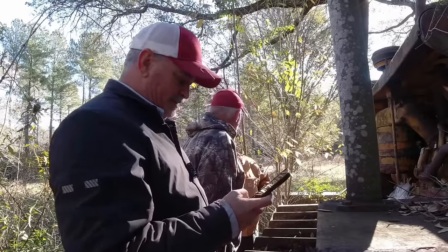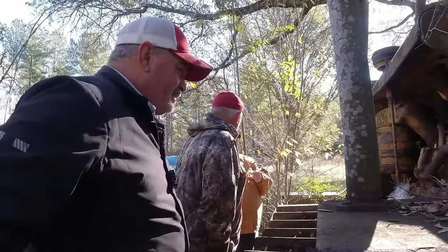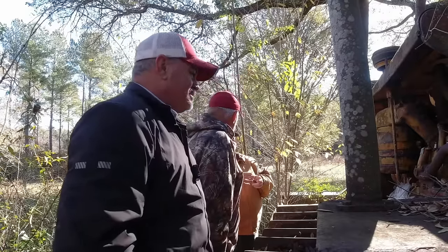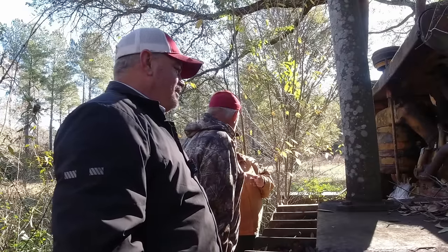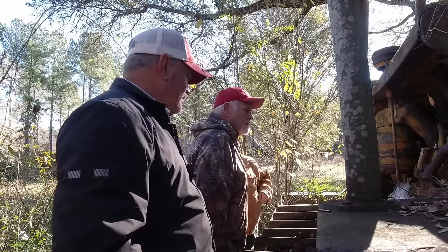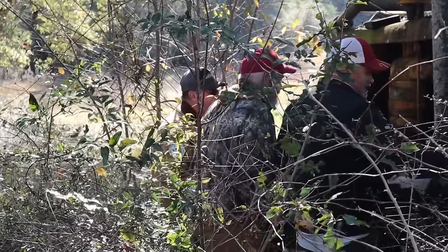Bye bye. It sounds like what he's gonna do is get the pony motor started with the starter. In other words, he's spinning the pony motor, but you engage your big motor while the pony motor is spinning with the starter, and then hit your compression release to get it. That's what he's trying to do.